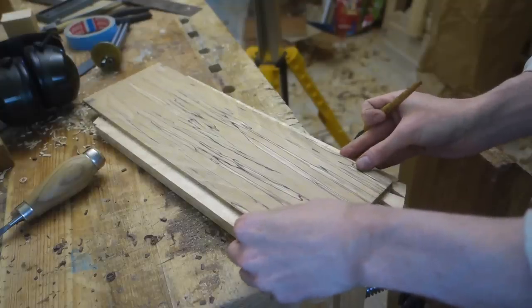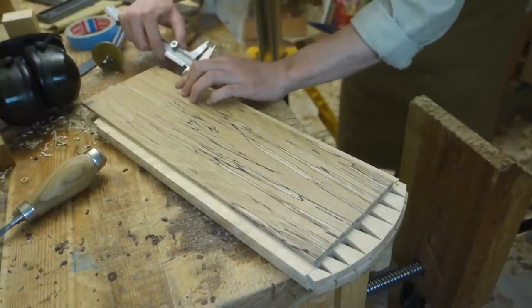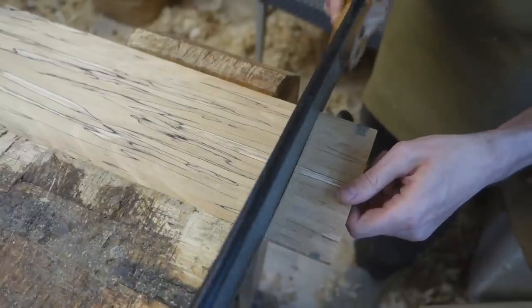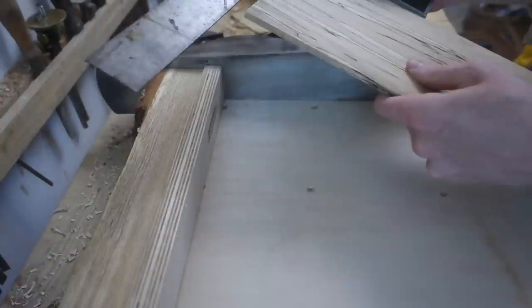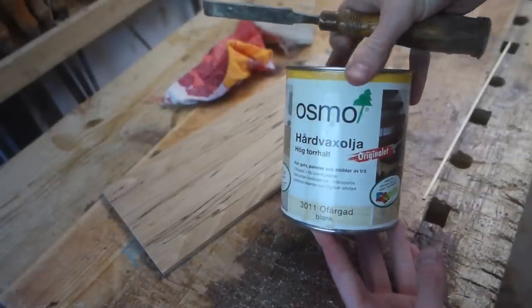After that, I could cut the lid panel to length, lining it up with one dovetail baseline and adding two groove depths of length to the other end. Why not line it up with stops of the stopped groove? Well, I made the grooves a smidge over length to make sure they are not too short, and therefore a panel sized to the groove length would not fit in the assembled box.